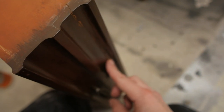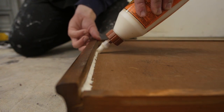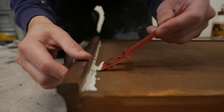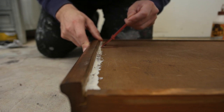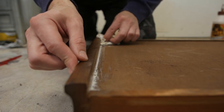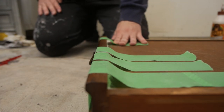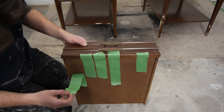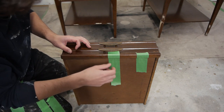One of the drawers had a big crack in the bottom — it was basically just hanging off — so I needed to put some wood glue behind the piece. I'm using a foam brush with the foam ripped off to push the glue under the crack. When finished, grab a rag and clean up the extra glue. Instead of a clamp, I'm using tape and laying paint cans on top to hold it while it dries. After letting it dry completely, I pulled the tape off and it was very sturdy.